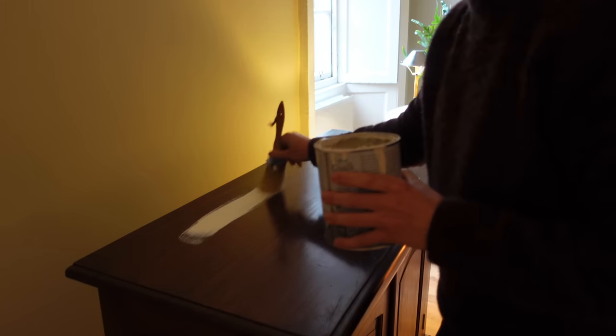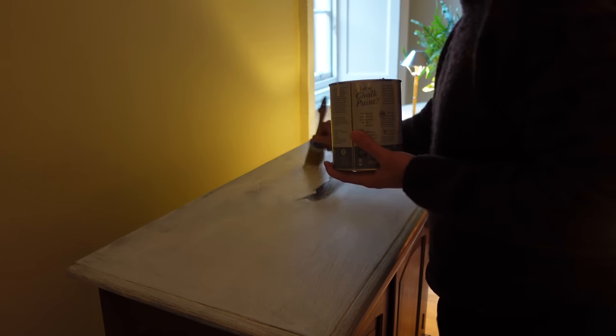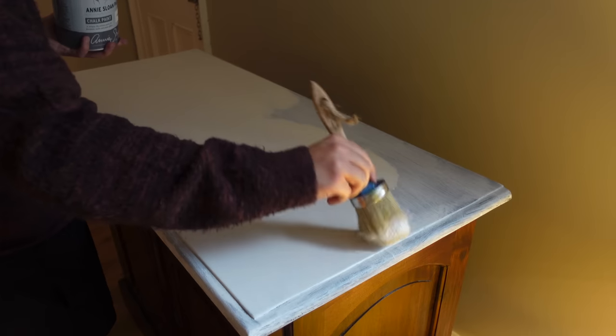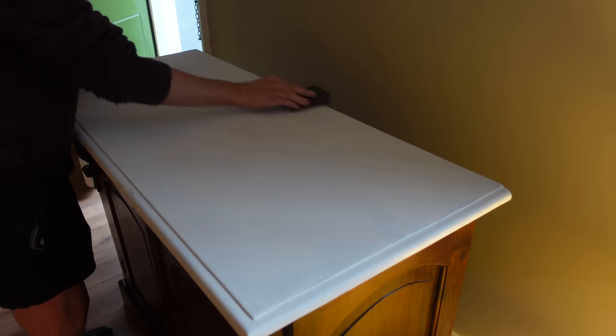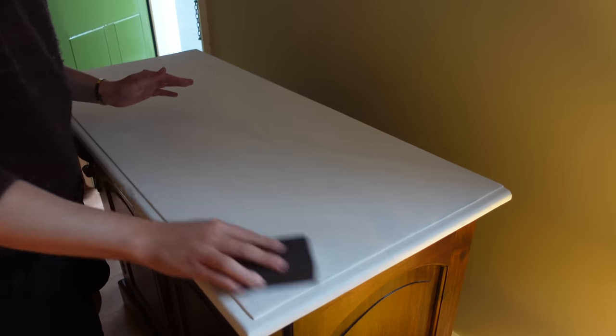I'm beginning by preparing the piece of wood — I use methylated spirits just to take away any grime and dirt and to prepare the surface so it can really grip the paint. Now I'm just applying the chalk paint over the piece of wood. The great thing about this dark mahogany is it really grips the paint very well, so you don't need to do any prep work. It needed two coats, so here I am applying the second coat. Then this is lightly sanding down the piece with a very, very light touch — just skimming over to remove any grain and paint strokes so that we get a really smooth finish.